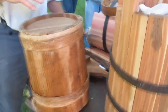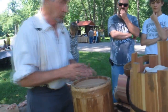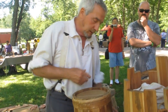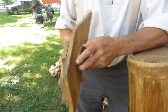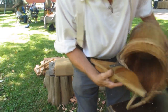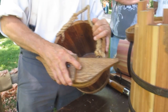Now we go to the bottom. Remember I said the bottom has to be a circle — I cannot measure an oval, I have to have a circle. So I will actually use another hoop, lay it down there, and maybe even scribe a line around it so that I can work the wood out to the line and I know I have a circle. Then I insert this tool which is called a CROZE — C-R-O-Z-E. That's how I make the groove in the bucket to put the bottom in. Without the bottom being in there, I will simply use the bottom as a guide where I've already trimmed it.